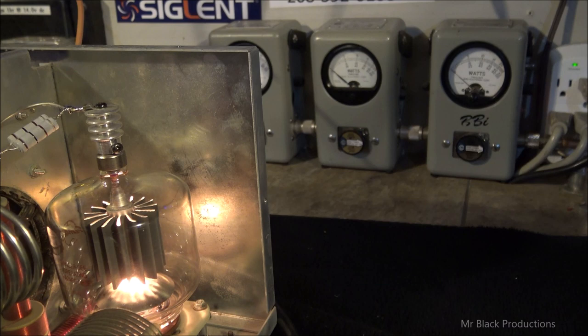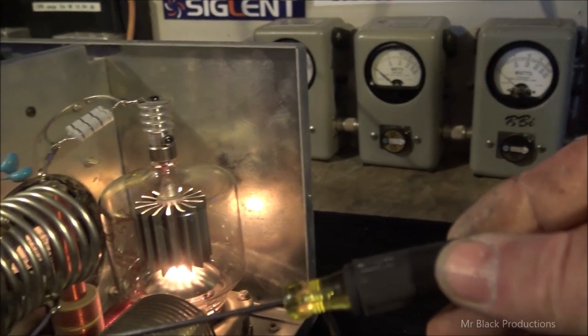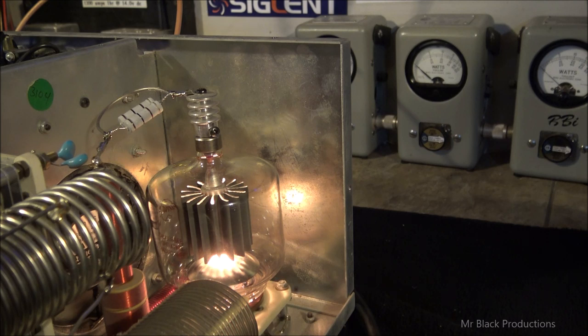Okay, now, like I said, we got to go fix this soft start issue with that board flopping around loose in there. And then the other thing I want to do is change this right here, and make it so that never can happen again. We're going to add some copper to it. A little bit of copper strap.